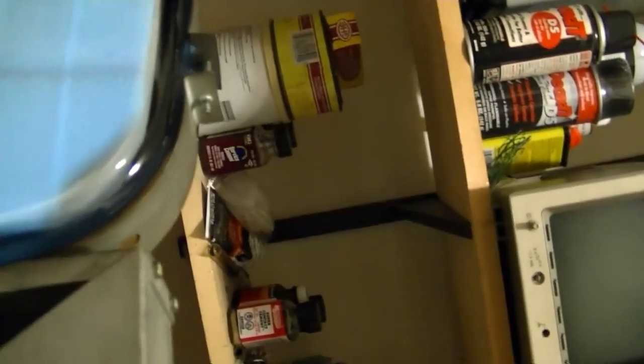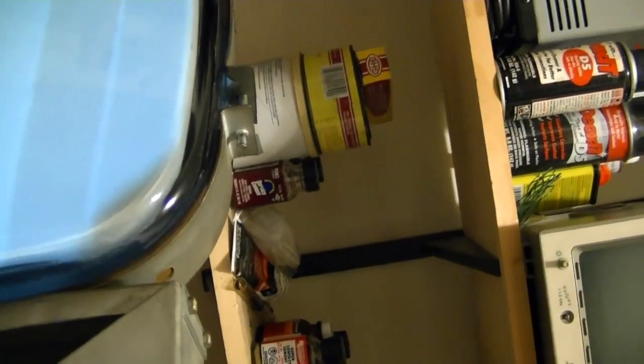So right now I've got a bias of around minus 15 volts. I'll leave the light on. That should be alright. And now I'm going to adjust that cap. As you can see, as I adjust it, I'm turning it down now, so I'm going more and more positive with the bias. Now the screen's just blanked out. I'm not going to go the other way.